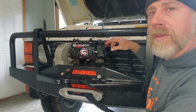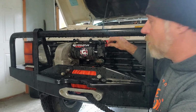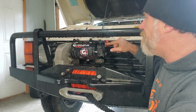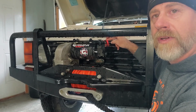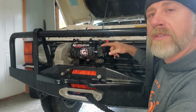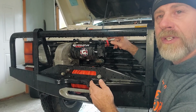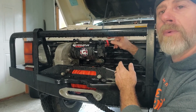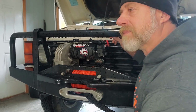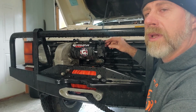And you can still simplify it. It gives you an option to check different things fairly easy, because you can unplug things right here, put a meter on it, put a test light on it, and see where you're getting power and all that. But like I said, the best way is just to run off of your known good power source and start testing these components and then just backtrack from the motor. Motor's good, solenoid's good, transceiver's good, handheld remote part is good. As soon as you run into something that's not good, well, then there's your problem. And you either got to fix that, replace it, whatever you got to do to keep going.